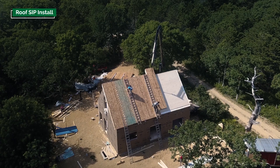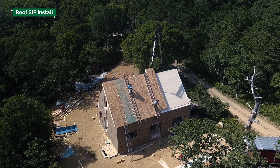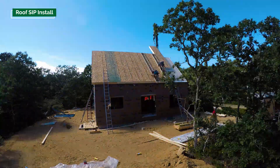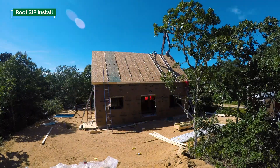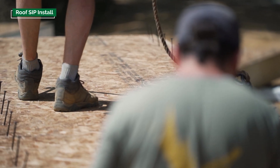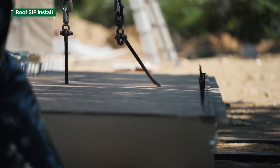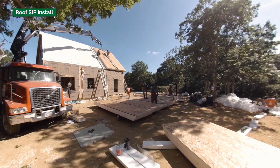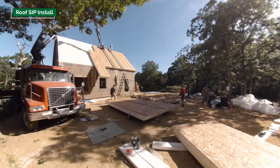What we found is that a panel that's four feet wide, because of that tendency for the skins to be kicked a little bit, actually occupies about 48 and one eighth of an inch. We have found, through about 30 years of panel installation, that this holds true almost perfectly. So if we're looking at stringing together six panels, there are five joints, and we know that the thing is going to occupy five eighths of an inch more than the actual panel widths.